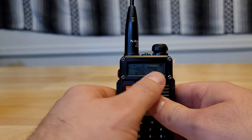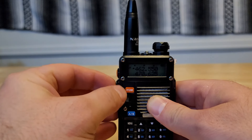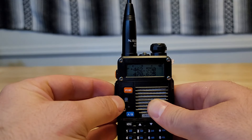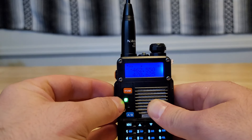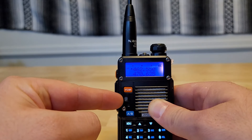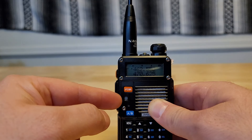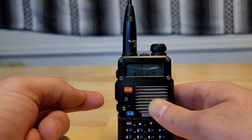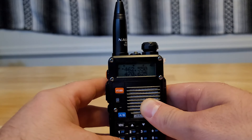Now to verify — before I transmit, I have my CTCSS tones and a positive offset set, and my receive frequency. Because I set that offset, when I transmit you'll watch the 462 turn to 467. That little squelch tail tells me I accomplished what I was trying to do — I keyed into the repeater, and that was the squelch tone from the repeater being activated.